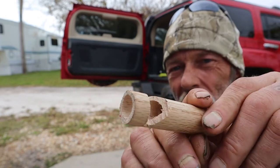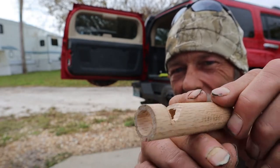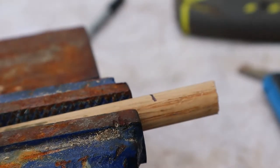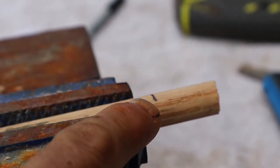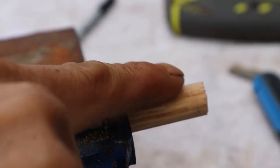There's a little notch cut out of there now. It's time for us to work with that half inch piece of dowel. I've got a piece probably about four or five inches extra long so we have room to put it in the vise. I made a little mark as a target and I'm gonna take a file to the end down here about halfway through.